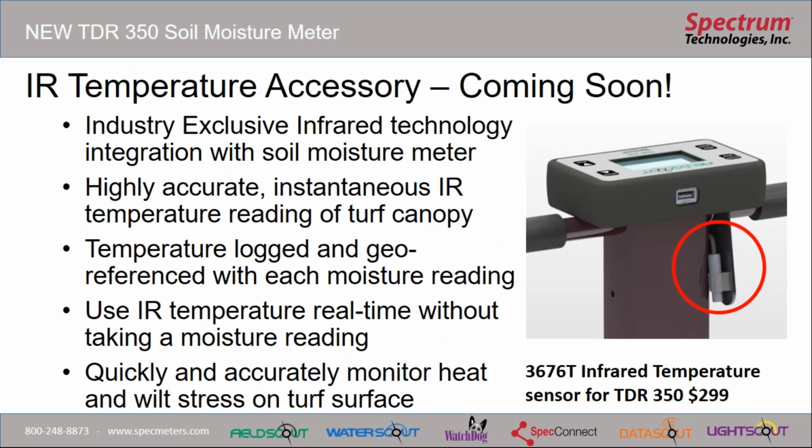The infrared temperature accessory is also going to be coming soon, probably available around the same time as the meters are available. This will give us the exclusive ability to geolocate an infrared canopy temperature along with your moisture readings. We would be the only moisture meter that I'm aware of that offered that capability. This is a highly accurate and instantaneous temperature reading of the turf canopy. With the shaft of the TDR 350 fully extended, you would have about a 6-inch spot on the turf just in front of the meter that you would be measuring, and that would take into account that leaf blade temperature and that canopy environment.